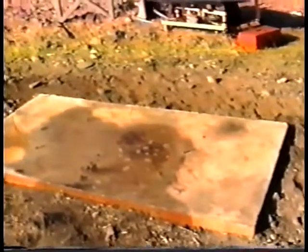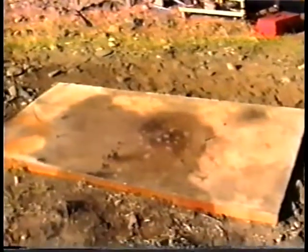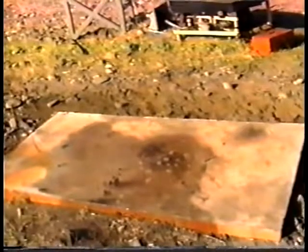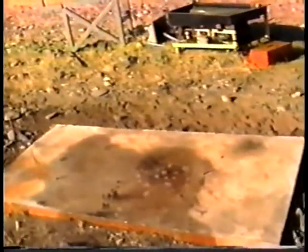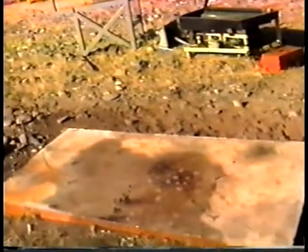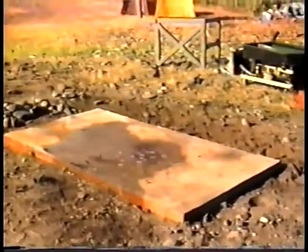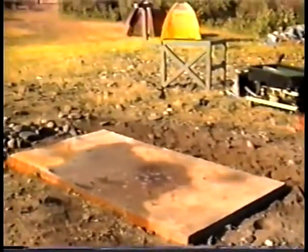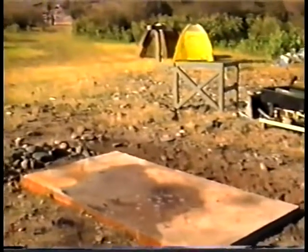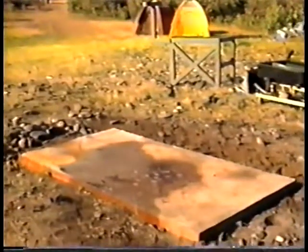This is the slab that we built down the river. It's a three-by-six, about a three-inch thick concrete slab. What we did: we made a plywood template, put it on the frame to mark the holes for the mounting — made it real easy and simple. We took some 5/16 bolts and welded them to a metal plate. We have two different forms of mounting on here. Now we're going to put the frame on there, bolt it up, and level it. You have to level the frame to the table to make sure everything is as level as possible, because you can adjust the angle of the table itself to control the flow of material being dumped into it.